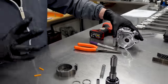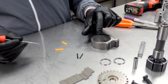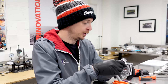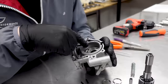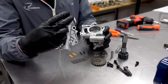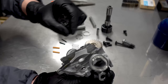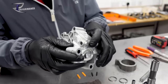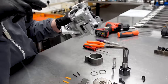Blades - they're the wipers. And the important bit not to lose. That is a pump stripped. We have a stripped pump. So: intake - it's obviously coming out, gets sucked in the intake which is this side, gets picked up, pulled round, and then forced out of that hole there. Which comes out and back-fills that chamber. So it goes in there, back-fills that chamber, and comes out here. Pulled up through the tip, pulled up through the pumping vane, and then pumped out the top - and that's it.